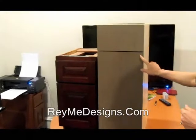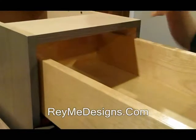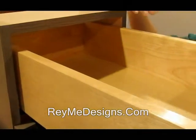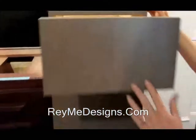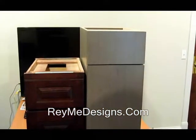However, we can put traditional doors on this as well. One of the main benefits I love about the frameless is in the drawer box. Since you don't have that face frame on the tops, sides, and bottom of your drawer opening, your drawer box can actually be wider and deeper. So you actually save space going with a frameless cabinet. And again, when it's closed, it's very neat and very clean.